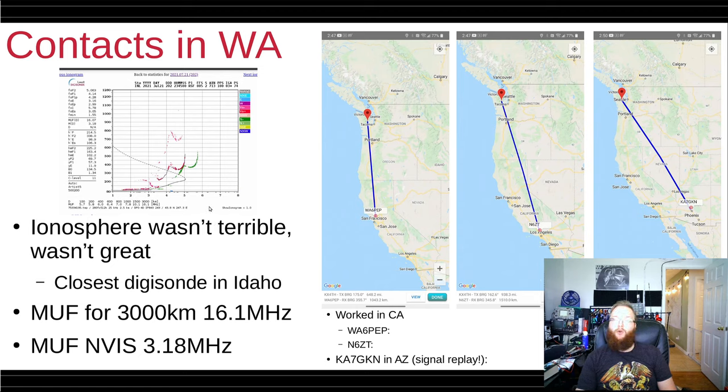One thing I will mention was that the noise floor was absolutely stunning. I had both preamps on the IC7100 — it has a two-stage preamp — and I could have the preamp on full swing at preamp 2 and still have hardly S1 of noise; it would just barely tickle the meter. The noise floor was incredible, and thanks to that in part, I was able to make some contacts. Let me see if I can play some of this for you.